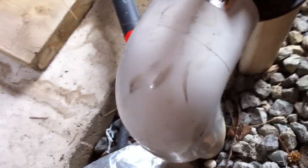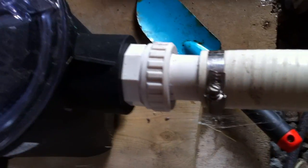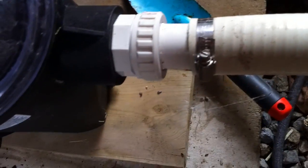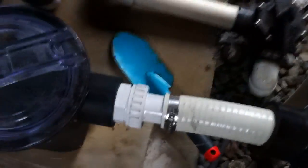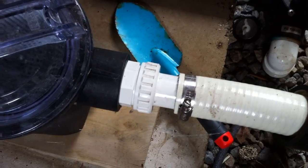But if I had a two-inch suction line, I wouldn't reduce to inch and a half — I think that's even inch and a quarter right here. So you've got a two-inch suction line reduced to inch and a quarter. That's no good at all. That absolutely should be a minimum of two-inch. This clamp is no good — it's not leaking, but I wouldn't trust that to not blow off. That should be bigger. And as a result, this pump is experiencing a fairly significant resistance to flow that it has to overcome just because of that restriction right there.